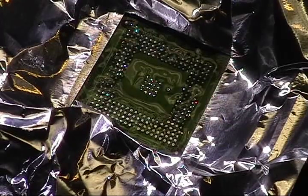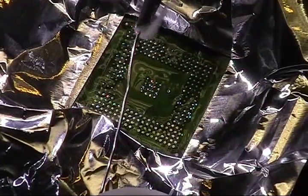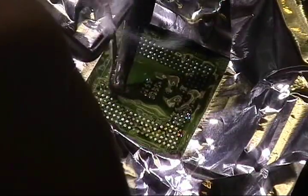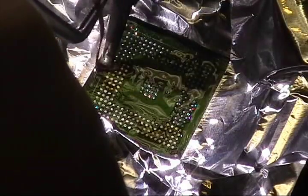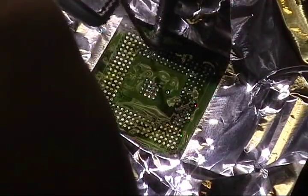And then, I mean, you're going to have to stop, cut the piece off, clean off the tip of your soldering iron, and re-tin it. You don't want too much when you're doing it. You just want a little bit on there. I'm not an expert at this, but it just picks up the solder that's on the pads so much better versus trying to do it without tinning it.